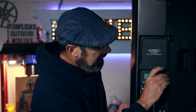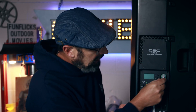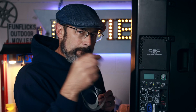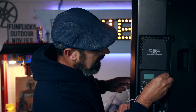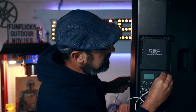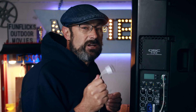You need to take the knob off carefully — put your nail underneath it and just pull it off straight. The first one I did, I kind of yanked to the side and I actually broke this piece off. So make sure you take that off carefully. You'll see right here you have your micro USB — that's the flat one that is shaped, so make sure it goes in the correct way. Also double-check that the cable you are using is a data cable and not just a charging cable, as it may not connect to your Mac or PC.